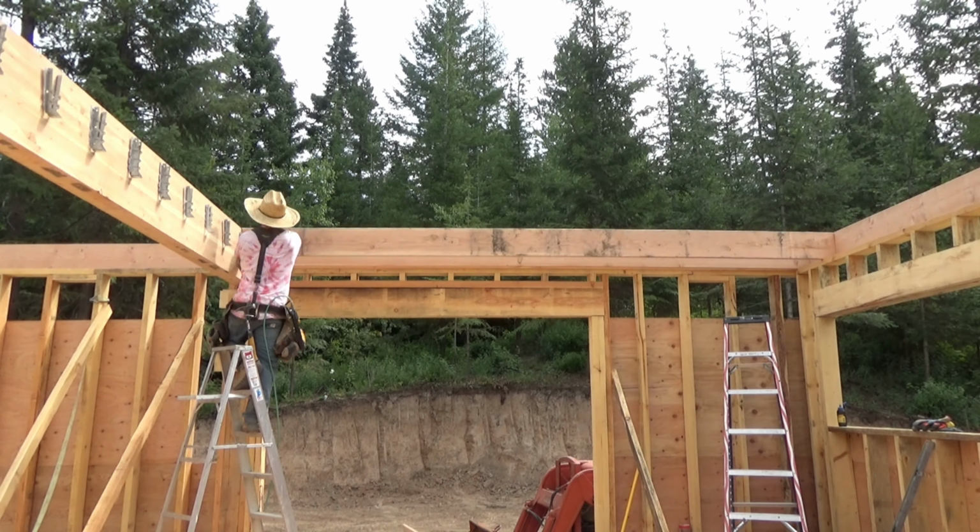But anyway, what I'm gonna do here is measure off of the house exactly how far this line is. So that way, whenever I need to tie into it, going to the shop, or maybe I won't, maybe the shop will be back here, but I'll know exactly where the water line is. Feet from that door, there's a door right there, directly straight out, 34 and a half is the center of this trench. And it curves going down, starts a little bit further down, but it starts to curve right about there.